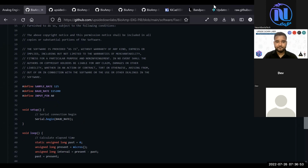Okay. Yep. And if you have a Raspberry Pi Pico, use that with some resistors. Or for EOG and EEG, we tried without resistors, as in your voltage divider resistors to convert the 5 volt signal to 3.3 volt. Without those resistors, it also works great, and you get a 12-bit like resolution. Although the ADC of Raspberry Pi Pico by default is a bit noisy, you have to check the data sheet to connect one pin, the analog reference pin, to I think VCC to make it better.